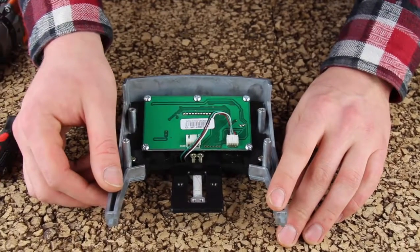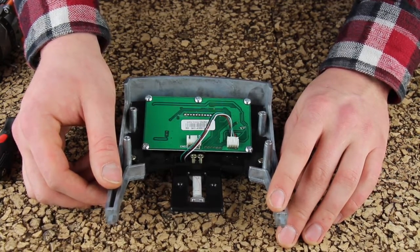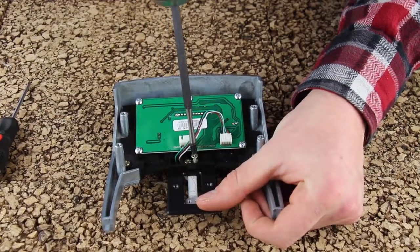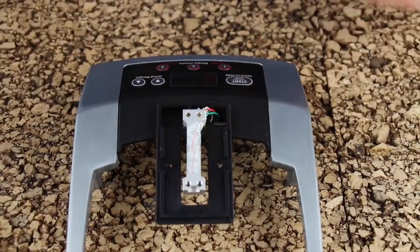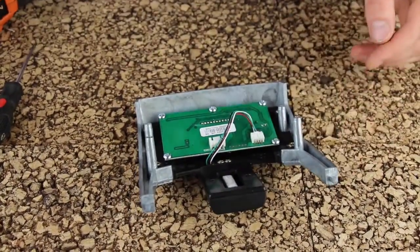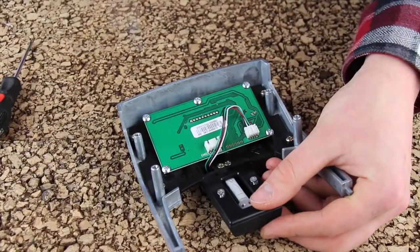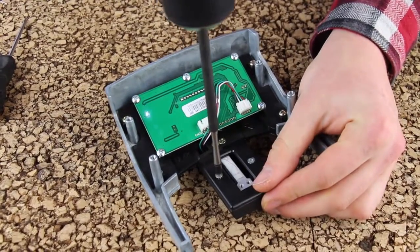At this point, we need to take extreme care to be gentle with the load cell. The load cell is a delicate part and can have only a maximum weight of 300 grams applied to it — it is easily damaged. You'll note that I am installing this load cell with power tools; however, I have turned the torque of my power tool to the lowest setting possible. Once the two gold screws are snug, we can get the plastic housing and fit it back into position.